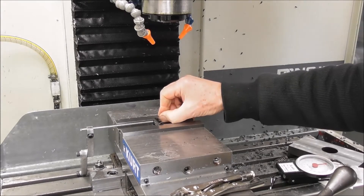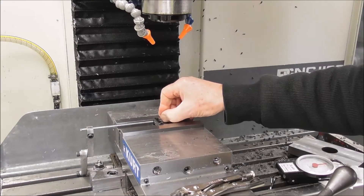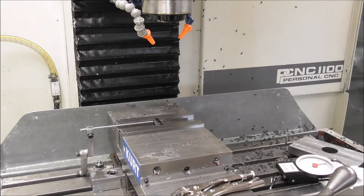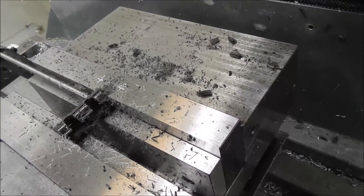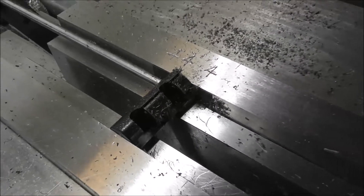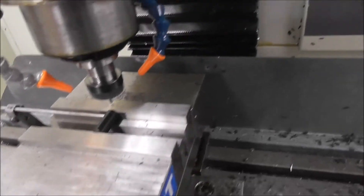It's all about the frictional characteristics of the surface — that's what matters. The little particles of grit, silicon carbide or aluminium oxide, are penetrating into the part and mechanically holding it so much better than the ground surface of a vise jaw. With those T-slot type cutters you can really cut on multiple faces, and I'm not worried now after doing that test with the wet and dry paper.